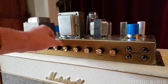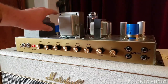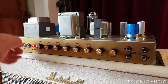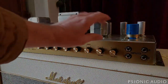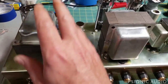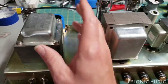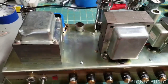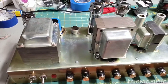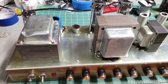It's coming through the output transformer right now — this power transformer is radiating noise, and when it's on it's injecting noise into everything else. The owner gave me authorization to do whatever's necessary to make this amp quiet. Before I spend his money on a new power transformer blindly, I wanted to make sure it really was the issue — and suddenly I just saw it.